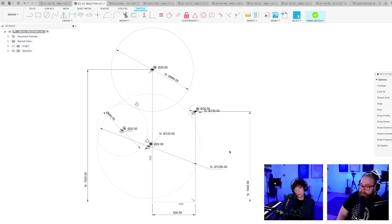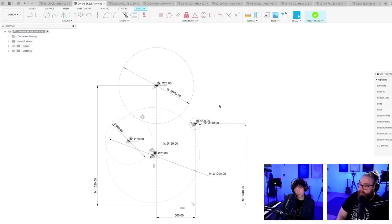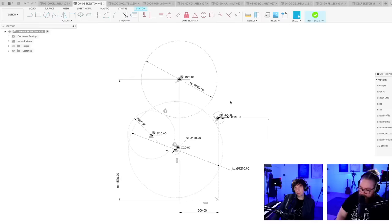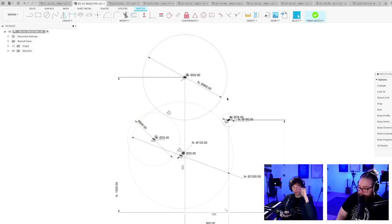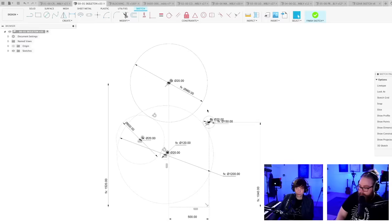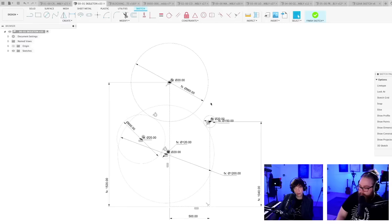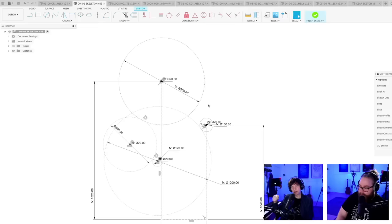SARQF: you don't need large pulleys, you just need the ratio between them to match the rotation speeds you're aiming for. Pulleys can be mounted on a central axis in the drums. Yeah, so that's the same point, but my point is, if you have a 1 centimeter pulley in the middle that drives a 1 meter wheel, you have a leverage issue there. You have to put a lot of force on a 1 centimeter small pulley to move the 1 meter wheel, and even more to pull programming pins and stuff. So at the end, it's a force multiplier if you make small pulleys. And this is why I'm trying to keep the gear train light to drive, and I'm trying to make the programming wheel brutally strong.